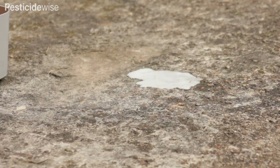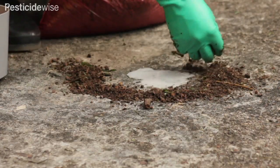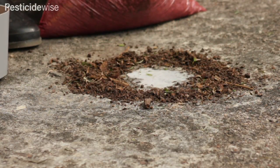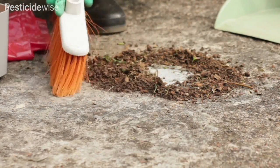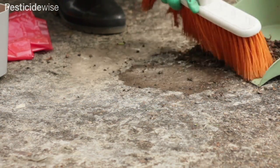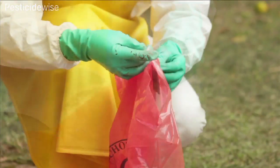If any accidental spill occurs, use the sand or sawdust in your spill kit to contain the liquid and absorb it. Do this as soon as possible and before it spreads too far, contaminates other surfaces, or, if on the ground, penetrates below its surface. Scoop up the contaminated material and place it in the plastic bag that is then sealed and labeled for safe disposal later.